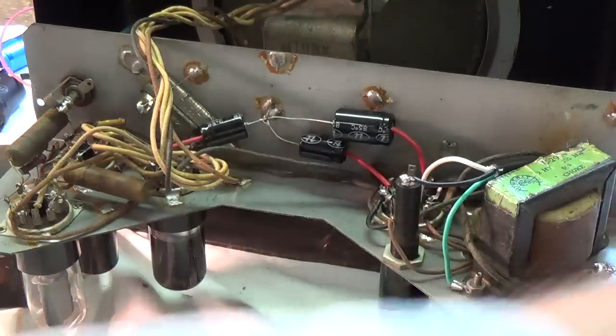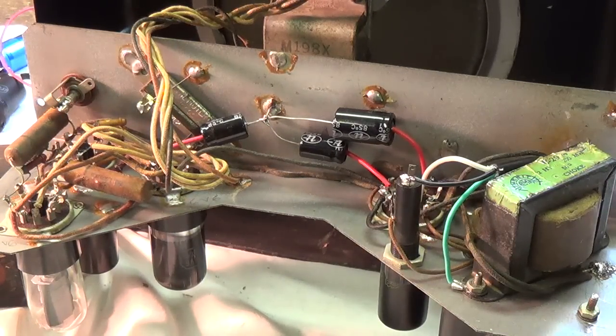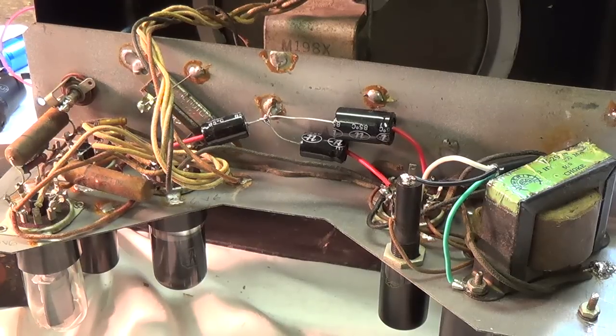Okay, here we go. I'm going to plug the amp into the current limiter. I've got the guitar plugged in up here to the input jack. We'll give it a second or two to warm up. I've got the guitar at about 5, say mid-range volume output. Not too shabby. Okay, just for laughs, I've cranked the guitar all the way up to 10. These are humbuckers, so we'll get a pretty good output signal. Remember that this amp does not have a preamp stage, so let's see what we get out of it.